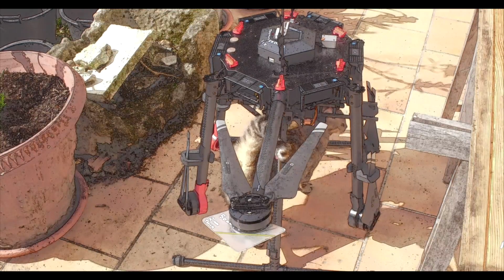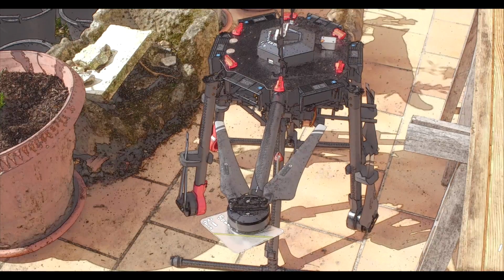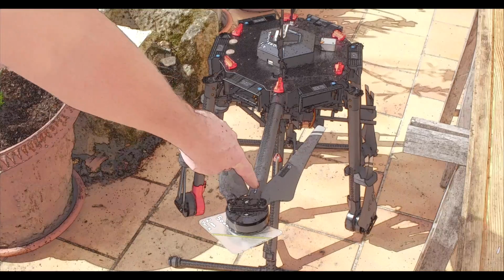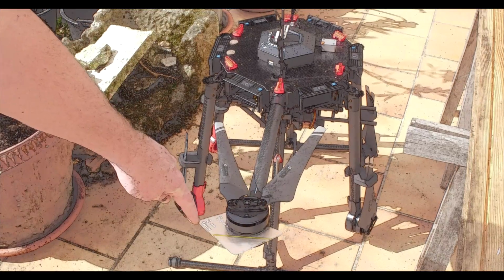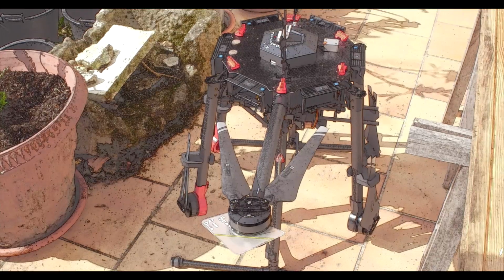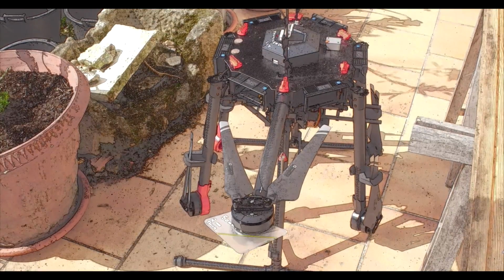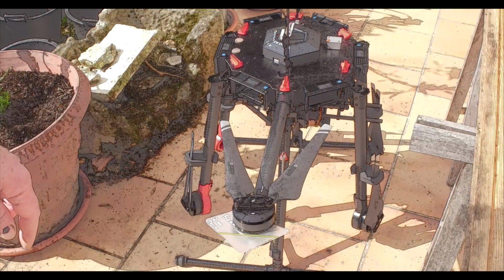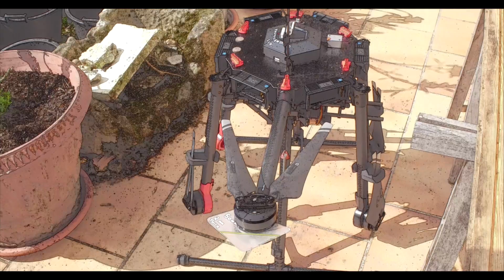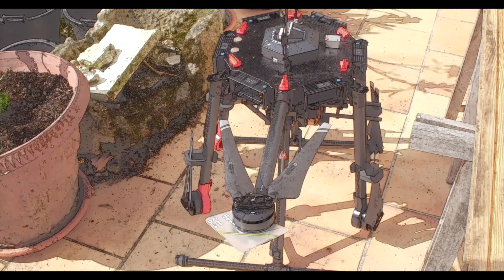Okay, so to sum it up, the major area for getting this correct is just getting this and this lined up correctly. So when it's 90 degrees to each other, then you'll have the most accurate reading. And the phone doesn't really matter how it's calibrated, because you're doing a delta reduction in the angle.